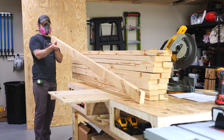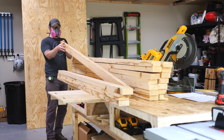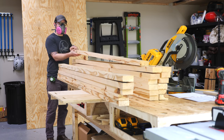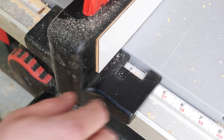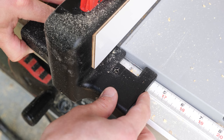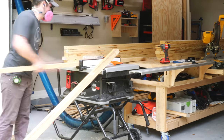After ripping, I went through my pile of boards and picked some of the straightest of the bunch to use as the framing for the workbench top. Obviously I wanted the top to be as flat as possible, so I really took my time selecting these boards. Then I set my table saw fence to 3 inches and ripped off the remaining factory edge from those boards to get them nice and square.